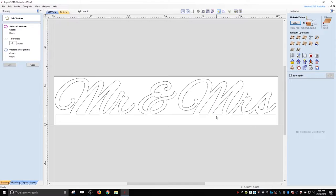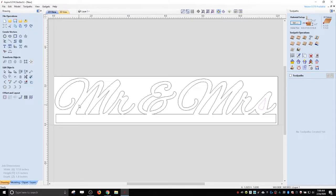So you have open two. So I'm going to join them. Go here. Join. Go here. Join. So this happened when I cut everything. So this one's good. It's got one closed vector. This one is fine. This one's fine. That one's fine. These are now good. That one's good. And then this one, we're good. Okay, I think that's it. So you have to make sure everything's joined together. Then we're gonna repick these internal ones. That's it. And then we're going to do a profile toolpath.